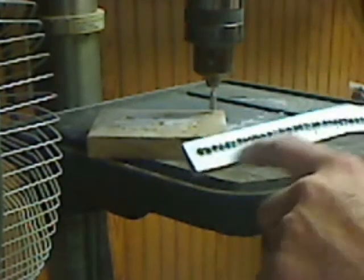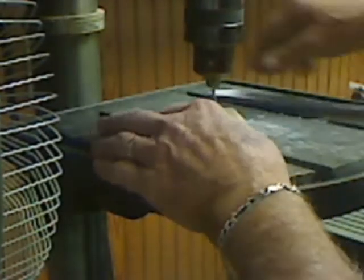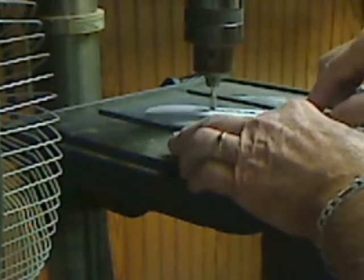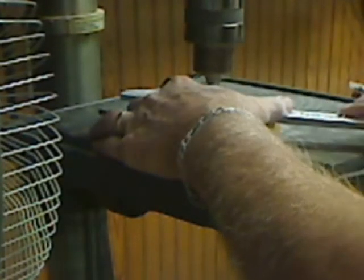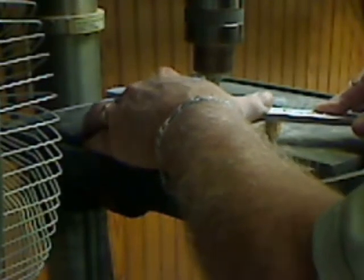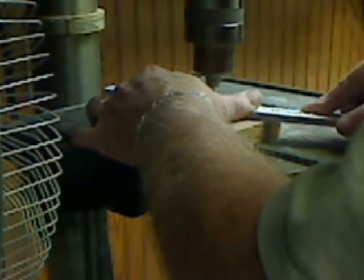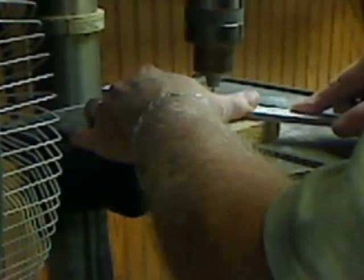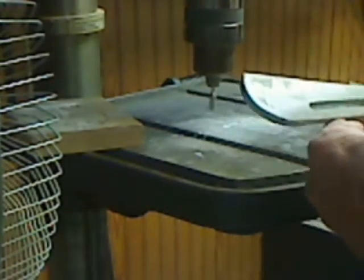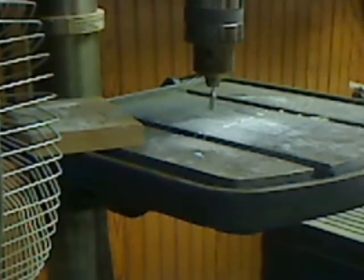I got all my holes drilled and I took my regular little Dremel tool with an ⅛ inch carbide bit and knocked out all the little webs between the drills. Now we'll put this on the carbide bit and see how this works out. And that's real nice — a nice smooth track, exactly one quarter inch wide.